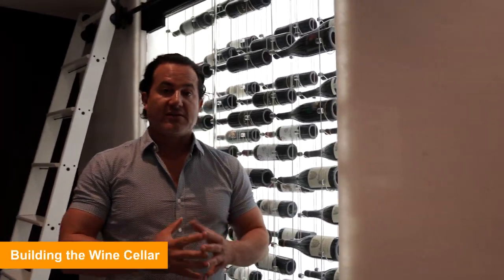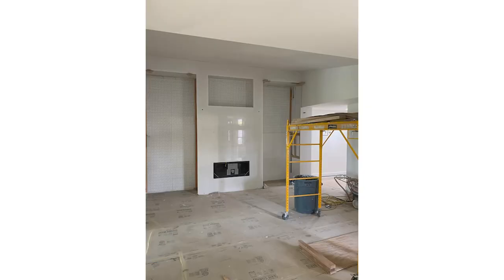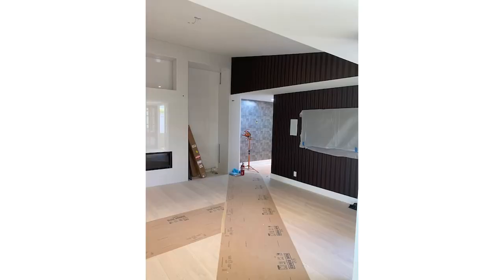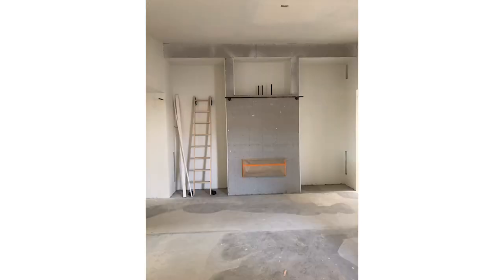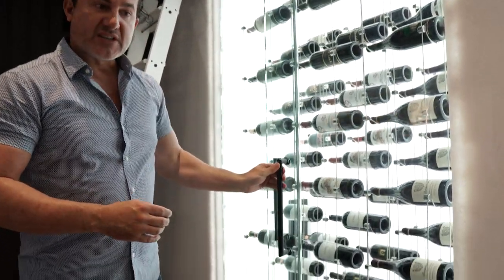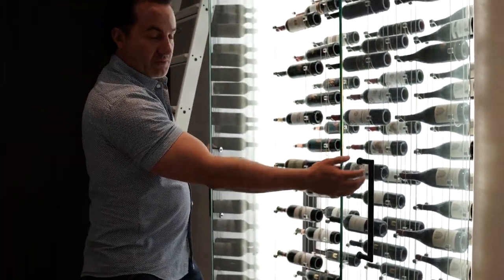When we were contracted, we came in to assess what was wrong with the cellar. Pretty much what was there was condensation on the glass — the glass was shower door hinges. This is a big thing: you do not want to use shower door glass on any wine cellar. You don't have the insulation of the glass, and the hinges have air gaps that cause significant condensation. All your cool air is going out the door and water was coming out of the sides. It didn't even have a seal, and when we opened the door it was stuck. Now you can freely open the doors with a door stop so we don't hit the racking itself.